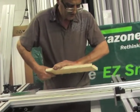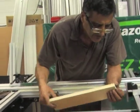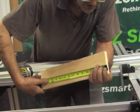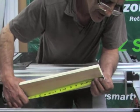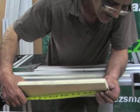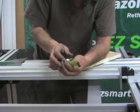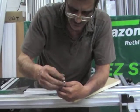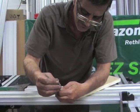But there is a problem with these things, and if you come closer I'm going to show you the problem. Right here this thing is bent — it always gets bent. This is something that everybody knows, and I've never seen a company try to fix this problem. You can see that the tip is touching and the tape is up by a 1/32 inch. So you need to make sure that this is straight and square — with pliers you can fix that. If you're wondering why your cuts are not perfect all the time, it's because of this.